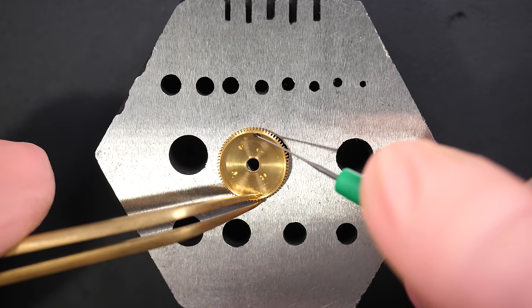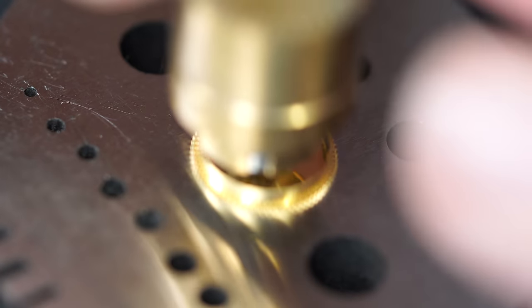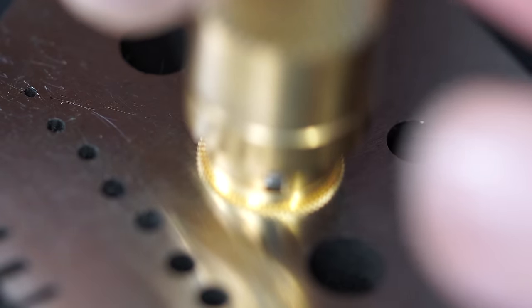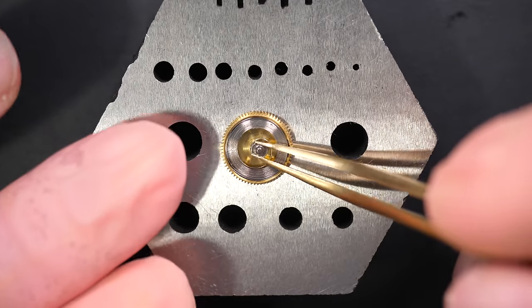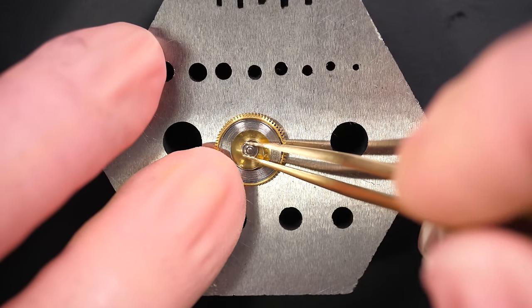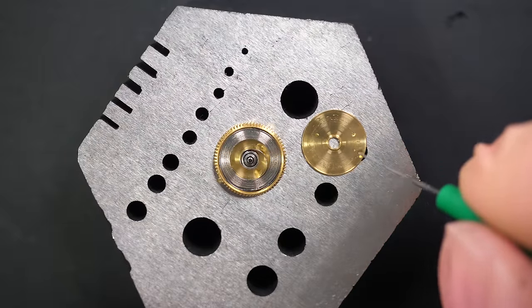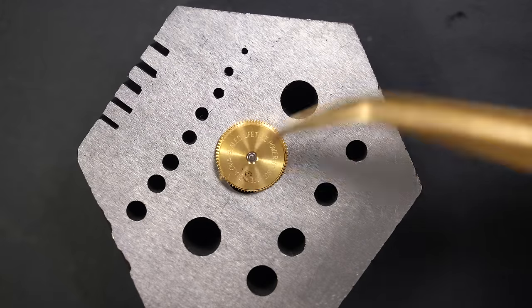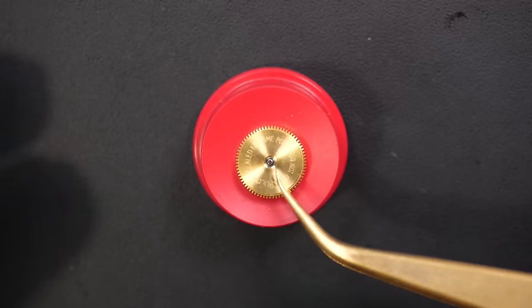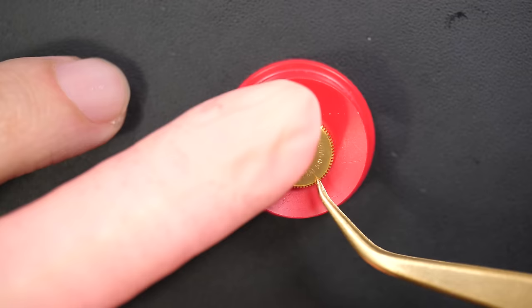Putting grease on the bottom and some graphite grease on the wall, because it's automatic — the mainspring will be sliding along the wall, so that's why you put graphite grease there. We pop the mainspring inside the barrel. Putting some medium viscosity oil before putting the barrel cover. We already checked the barrel cover — no friction, good endshake. Lubricating the top and closing the barrel cover. 'Do not open' — I promise I will not open this one again. Maybe somebody else will open it in a few years when it needs another service.